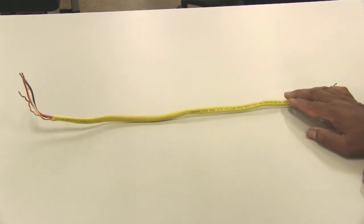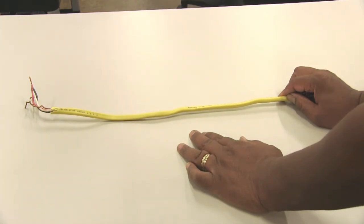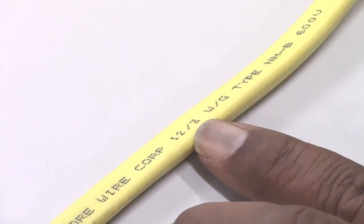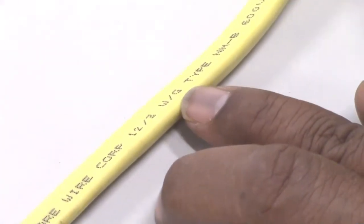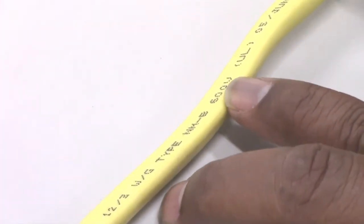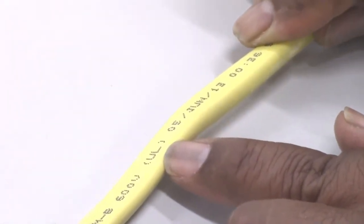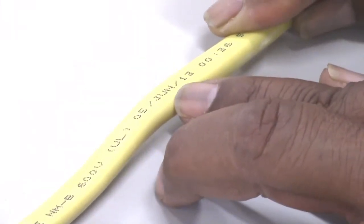Earlier I spoke about the various Romex conductors. On the table before you is the yellow-colored Romex, which is number 12 gauge. I'm going to go over the information you'll see on the actual Romex. It has Encore Wire Corporation as the manufacturer. Right next to it, it has the designation 12/3 — that stands for number 12 gauge wire good for 20 amps, with three conductors. The WG means with ground, which is the bare wire. The type is NM, which stands for non-metallic, and it's rated for up to 600 volts. You'll also see the UL marking, which means it was tested by Underwriters Laboratories. And it has the manufacture date of June 3rd, 2013.